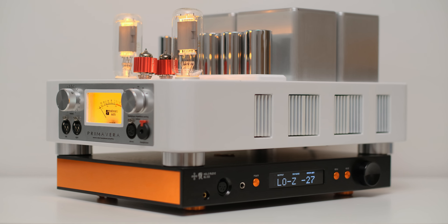Power-wise, we're talking 12 watts of pure Class A via its balanced connections in 32 ohms on the Low-Z setting, and up to 2.5 watts in 150 ohms on High-Z. The difference between Low-Z and High-Z is not gain — it's the output impedance of the headphone jacks. Low-Z stays very close to zero ohms, while High-Z sits between 8.5 and 17 ohms.